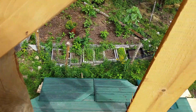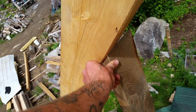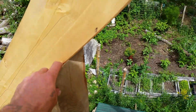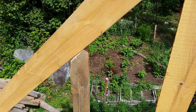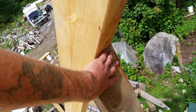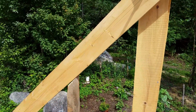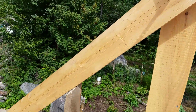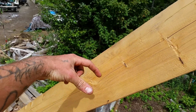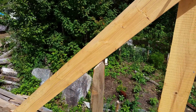So yeah, initially we were going to cut so they're flush with the inside of the rafters or even a little bit in, and there was going to be kind of a lip here to help the rafters be stabilized. But then we decided we're probably going to have them flush with the outside of the rafter like that, so that way our sheathing on the outside is all flush and fine. And just for these 2 end sets of rafters, so you see how this is hanging in like this, for the end sets we're going to end up putting a fake 2x6 stud here, not stud, but on the face of the rafter, so that it looks like the rafter is overhanging the inside of the wall a little bit.